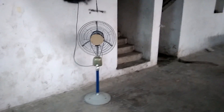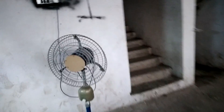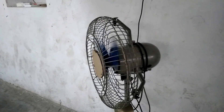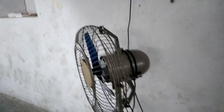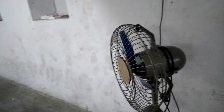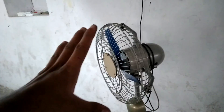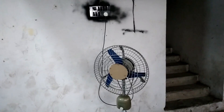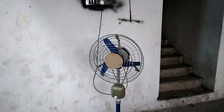As you can see, there are no weird noises. All the weird sounds from the gearbox are completely gone, and the load that the bad gear was putting on the new bearings is gone too. The new SKF bearings will last a long time. That's it for today — I hope you liked the servicing video of this fan. Please like, share, comment, and subscribe, and I'll see you in the next video.